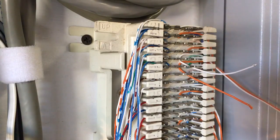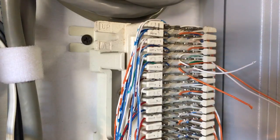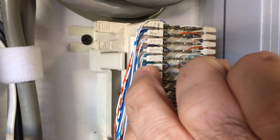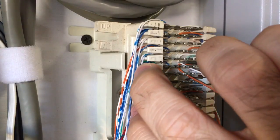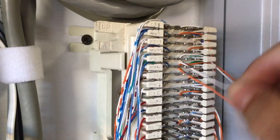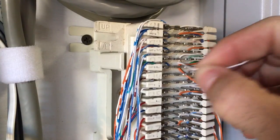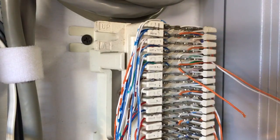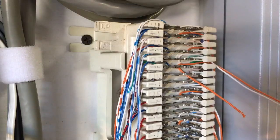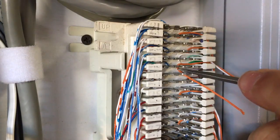This is where the small sharp screwdriver comes in. Without contacting the wire below, lay the tip of the screwdriver right on top of the excess wire, just about a millimeter below the pin where you pushed the wire down, and give it a couple of light taps. That should be enough to perforate it so you can wiggle it off. Give it another whack a little harder if needed. What you want is that excess piece of wire to fall off without pulling the seated wire out of its groove — if you wiggle it and the wire comes back out, you need to start over.